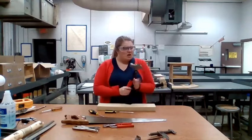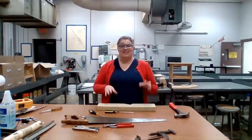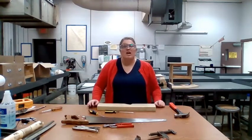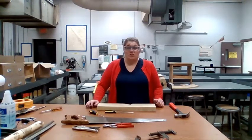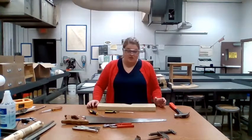We'll talk a little bit later, when we talk about fasteners, of some ways that you can get nails to better fasten, or if it's a very hard piece of lumber, how to get them to drive the nail into that board. Sometimes we have to do a little pilot hole drilling, which we do with screws all the time, and we don't always think about with nails.